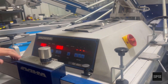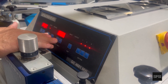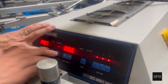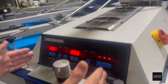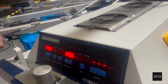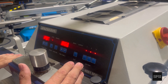Here we have the display where we scroll from temperature — if it's an option — down to time. The most common option is time. We have the function button, which scrolls between manual, where instructions are given from this area only and all instructions from the press are ignored, and automatic, where there are no instructions from the front panel — all instructions come from the press.